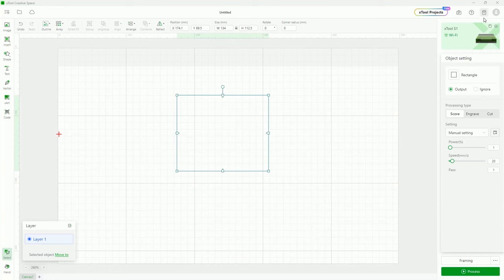This is a raster image — any type of photograph or anything that's not a line drawing. The key differentiation is that the only thing you can do with a raster image is engrave. When you have it selected, the only processing type available is engrave. But if you have a vector graphic — which is line art — you'll see you have score, engrave, and cut. So with a raster you can only engrave, while with a vector image you can do all of those things. Score just goes around the outline, and cut is where you slow the speed down to cut something out.